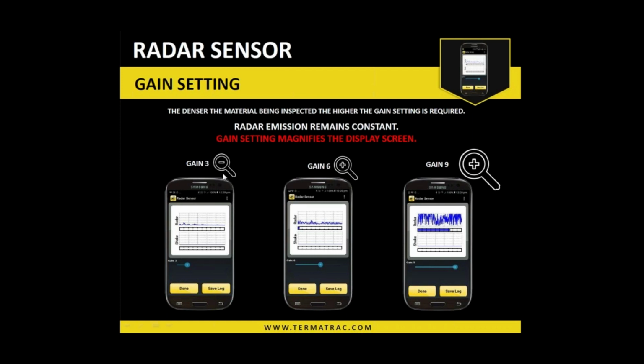As we can see here, we have gain 3, gain 6, and gain 9. And if you look at those pictures, moving from left to right, you can see it's getting larger as the gain level has increased. So you need to get it to a level where you can interpret the data successfully. If it's too small, you'll miss out on some of the subtleties, some of the clues. If it's too large, it starts distorting it for you. So again, it makes it very difficult for interpretation purposes.